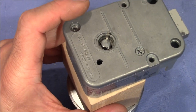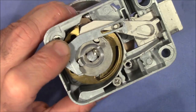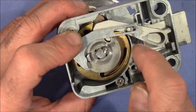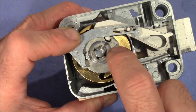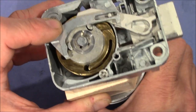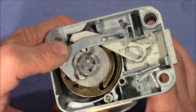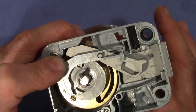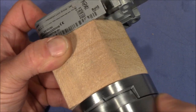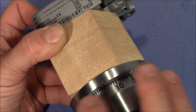We can remove the change key and we are ready to go. Let's dial in the new code — it was 10, 30, 30, 30, back to 5, and stop at the second time. Let's look inside and inspect the situation. We can see that the cutouts, the notches, are aligned perfectly and the fence has already dropped in. It has also engaged so that the drive cam has engaged with the nose here of this arm. Continuing turning the dial — this time to the right — the lock opens. Pretty cool. No big deal with the forbidden zone, you might think. But now let's try to lock it back up. Also works, but now it stops here — we are in a locked-up situation and cannot turn the dial anymore outside this range.